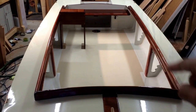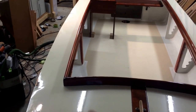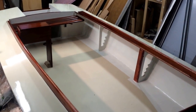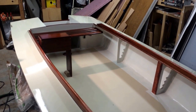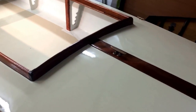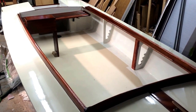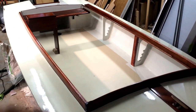Overall I'm pretty happy. I have bright work in the combing, the bench, the console, and the bow plating that I'm pleased with. I'm also relatively happy with how the paint came out — it's a one-part product from Epiphanes, the Yacht Enamel. One supposed benefit according to Epiphanes is that it's a softer product when finished, so it has very good adhesion but will also take more flexing without crazing or cracking — though time will tell. There are two coats of gray primer and two coats of paint as part of that system.